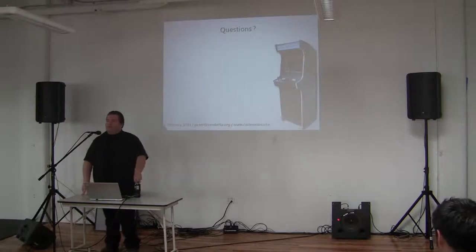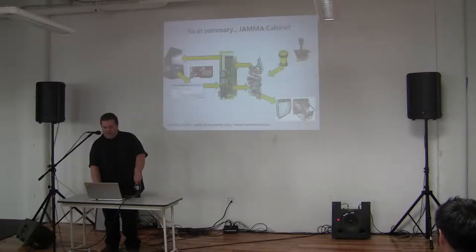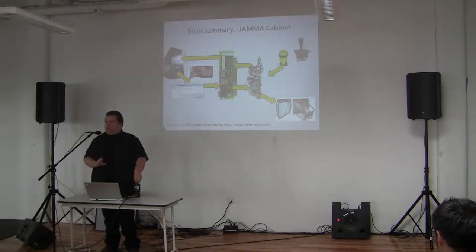Question: in the last diagram, you had the video output from the PC going into the JPAC board and then from the JPAC board to the display — is the JPAC board actually doing any video conversion? No. In this setup the JPAC is not doing video conversion. It's actually upping the voltages — VGA is 3.3 volts where the cable expects a 5-volt TTL level. So it's doing a little bit of conversion and also protection so you won't accidentally damage the screen.